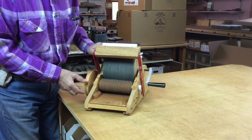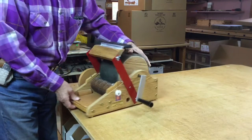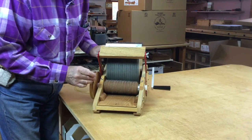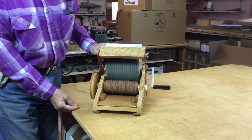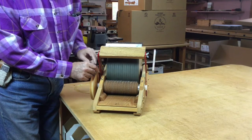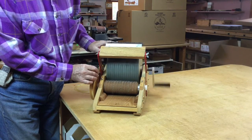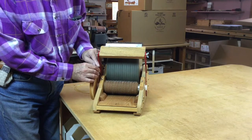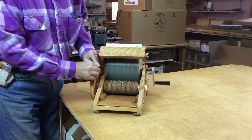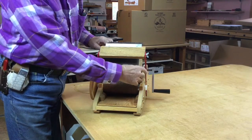You can tell by the noise when you're turning the large drum — it's a racket. So you want to put your rod in the hole, move up a little bit until the noise stops, then move it closer again until you hear the noise, then go back so it stops. And then lightly tighten your thumb screw.